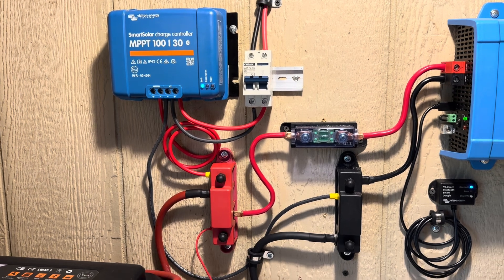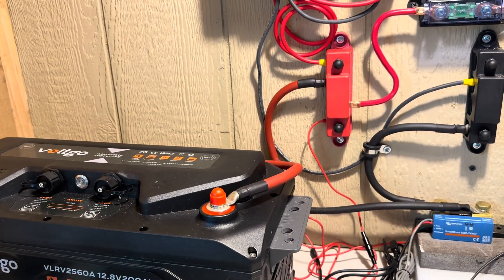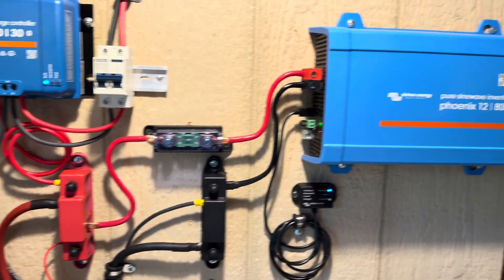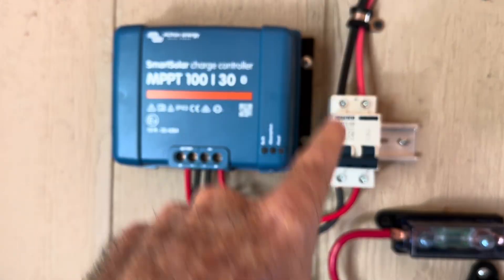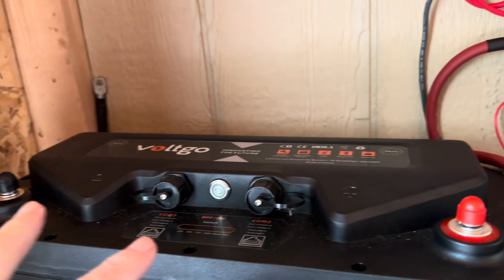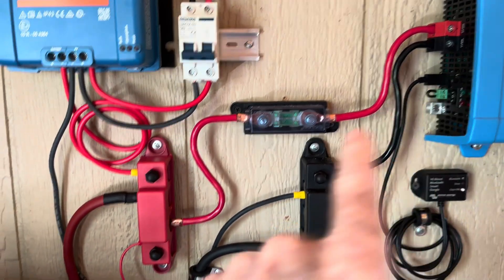So I'm going to shut this system down. I can leave the battery fully charged — I do have a little spare inverter I could hook up to if need be. It's not going to be an issue until I get a replacement. So I flipped the solar panels off; there was 400 watts coming into this system. And I disconnected my battery cable, so I'm free to go ahead and disconnect what I want to.